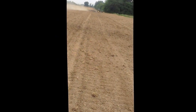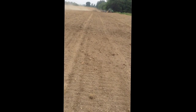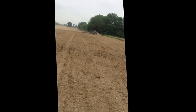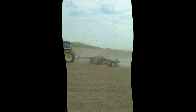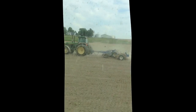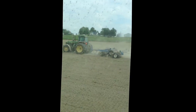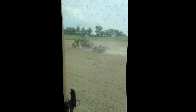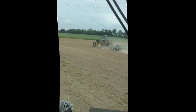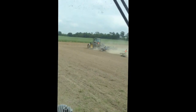We're finishing right in front of the planter. This is after a field cultivation and a roller, which was very rough. Now we're using our new little fun machine we've created with coulters to smooth it out really good. We're comparing this vertical tillage unit to a field cultivator, and you wouldn't believe how much smoother the ride is on the planter after this versus the field cultivator. The field cultivator is not bad, but this is like being on a freeway compared to a dirt road.